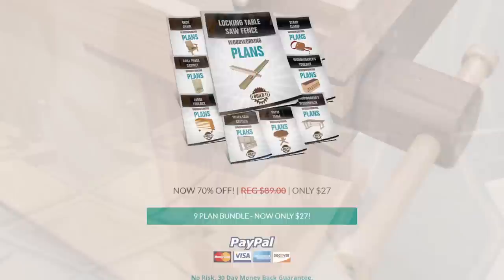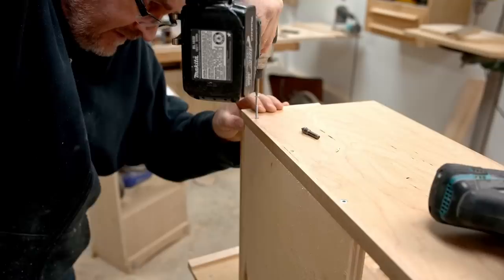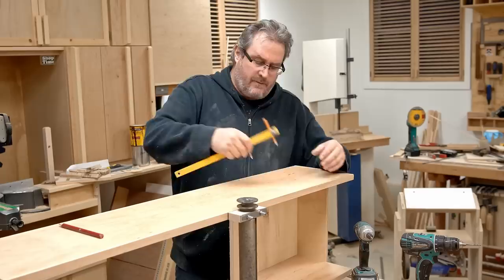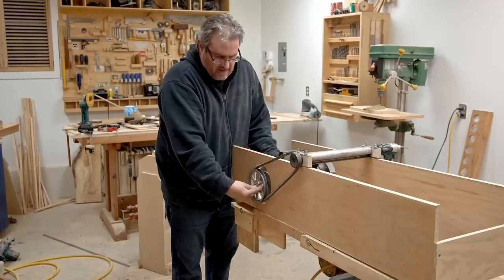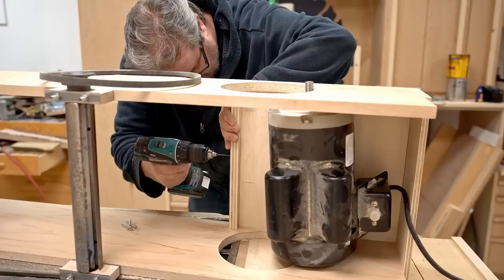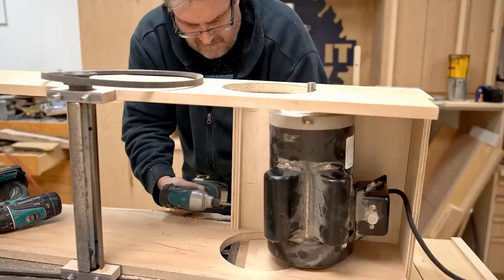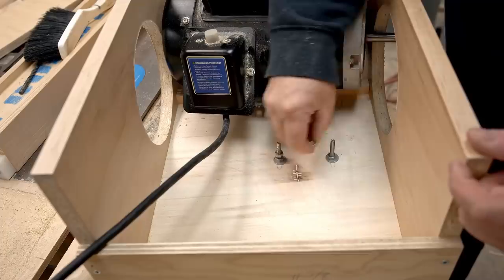Next I'm going to put in the motor, so I'm cutting a panel from three-quarter inch plywood for the motor to bolt to. I've got my beam compass set to three and a half inches to make a seven-inch circle, then I'll drill a pilot hole for the jigsaw and cut out the opening on both sides. I'm eyeballing it with the motor lifted up slightly, and I'm going to attach a strip to the front of the plywood for the base of the motor to go against. On the other side I'll put bolts up through the bottom and put nuts underneath the edge of the plate to hold the motor up, and nuts on top to hold it down, tightening the belt and bolting it down tight to the frame.